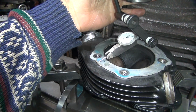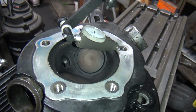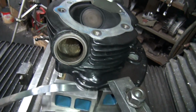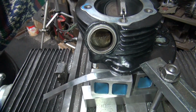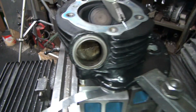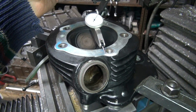Got super, super high. This started way up in there. Look at that. That's 8. Look at this side over here. That's 8 there also. So we got 2 8s right here on our highs. 5 over here. 4 over here. So we need more shim under this. Okay. So what do you put over? We got a 3 on the back side of that one's all we got. What do you need, sir? Okay, we're about 5 thou difference right now.